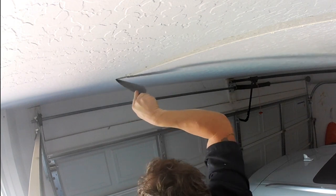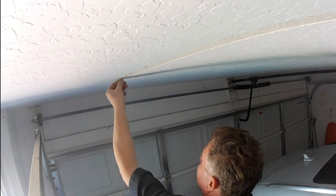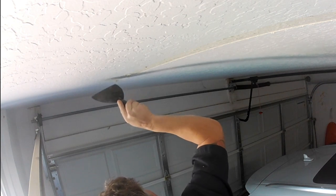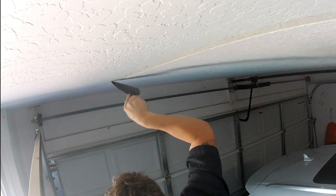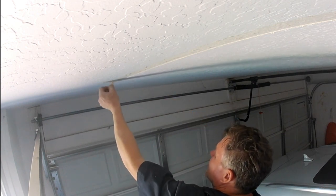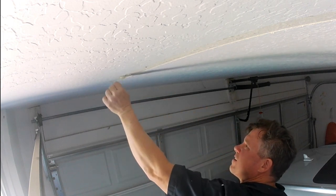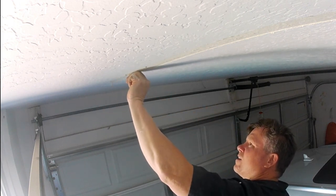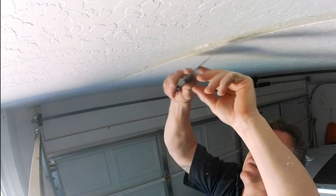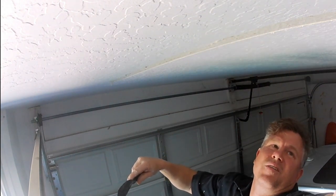You're going to have to do a V-notch technique, and I have a video on my channel showing the V-notch. So you can always V-notch, but that's worst case scenario. You always want to try to dig out the old tape. The only time you would V-notch is if the cracks were going diagonal, or if they were already repaired before, or you're not able to get that tape seam out. But you want to dig out all that old paper tape, all the loose little fuzzies and stuff, get them out of there.